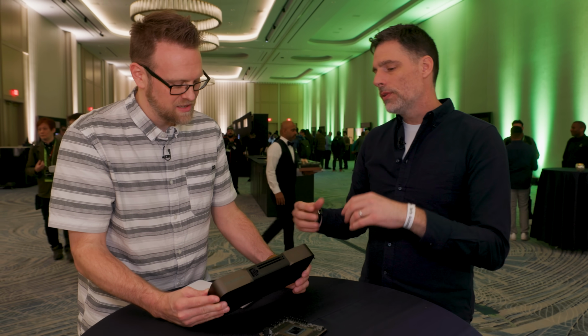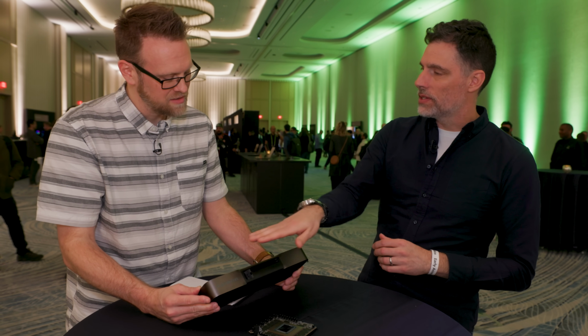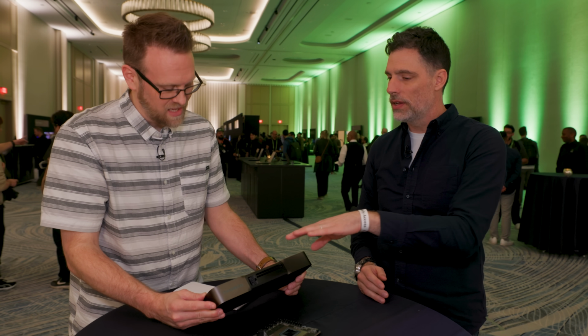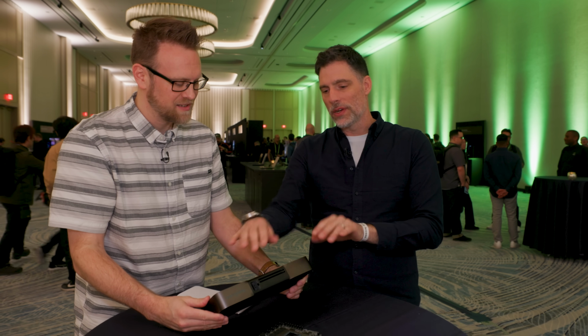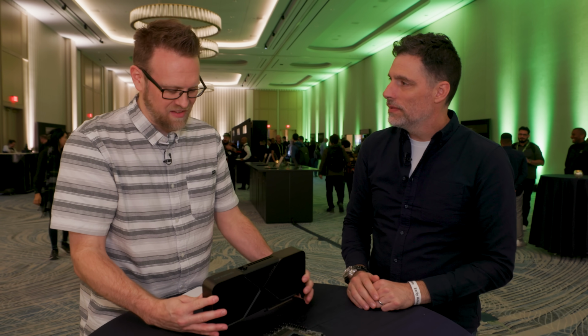So the way we've addressed that is to angle some airflow out of these slots to make sure the air stays going in the correct direction and doesn't recirculate back into the fans. So it's like creating a boundary. Yeah, imagine you've got this little air boundary here pushing the air back over where we want it. Okay, nice, interesting.